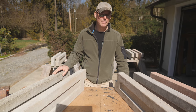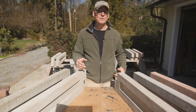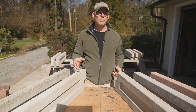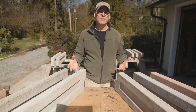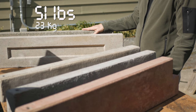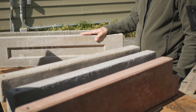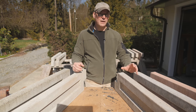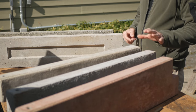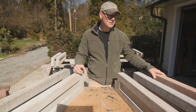The plan is to slowly roll up onto the panels and stop at the center of the span. If the panel breaks, it will be interesting to see where that happens and whether the connection point is the weak link. I'll try the regular sand and gravel Portland-based panel first. I have more 36-inch panels than any other size, so that will be the length for all the tests. The first panel is regular Portland-based sand and gravel concrete, weighing 51 pounds. The second is the red lava rock mix from part 3, weighing 46 pounds. Next is the vermiculite blend, weighing 35 pounds, also from part 3. Finally, two perlite blends from part 3.5 — the black tinted panel made with CSA cement weighing 29 pounds, and the red tinted panel made with Portland cement weighing 35 pounds.